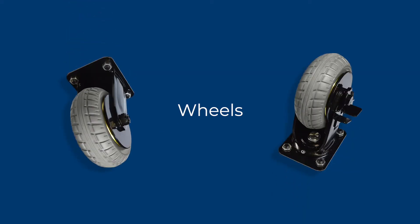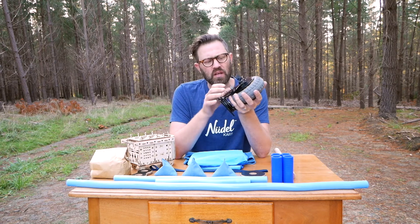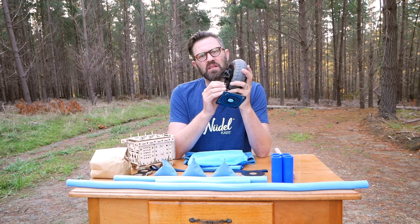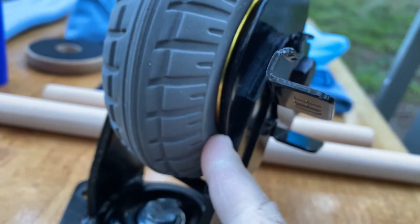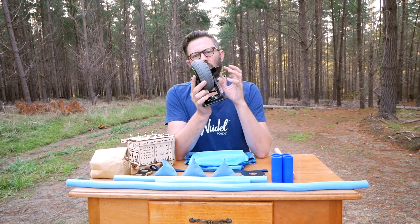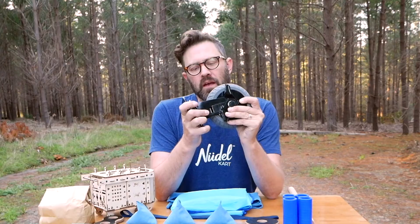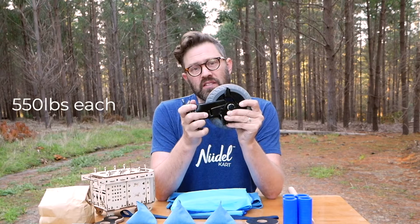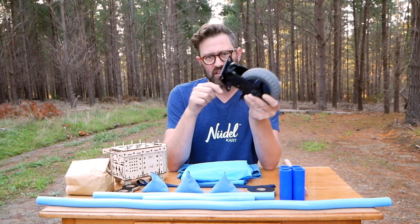These caster wheels come from two different suppliers. The black caster wheel frame came from one supplier and then we had custom made — to meet safety standards — these special black washers. What these washers do is fill in the gap between the wheel and the frame, which is really important as it removes any entrapment hazards. We actually had to custom design this complete assembly with manufacturers to make something that worked. These caster wheels are rated to 250 kilograms each, meaning the four caster wheels together can carry one metric ton.